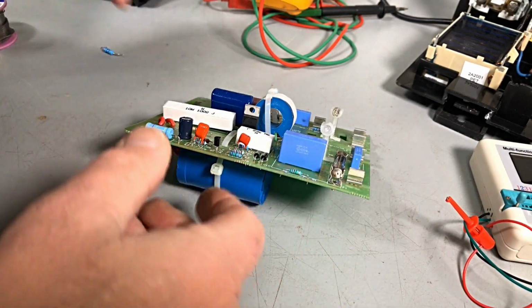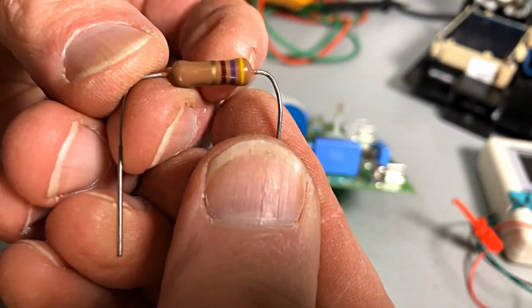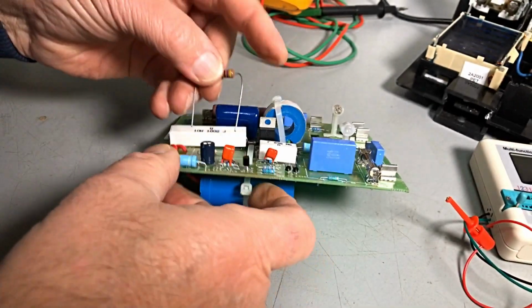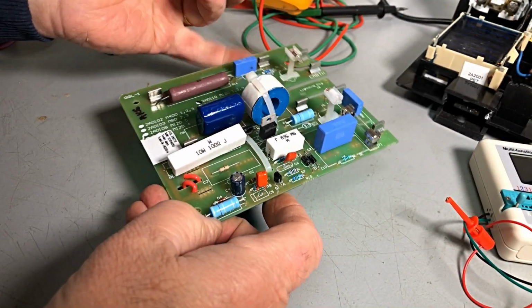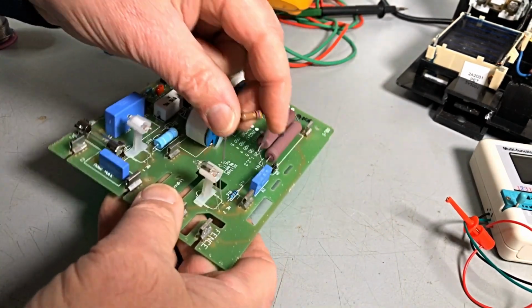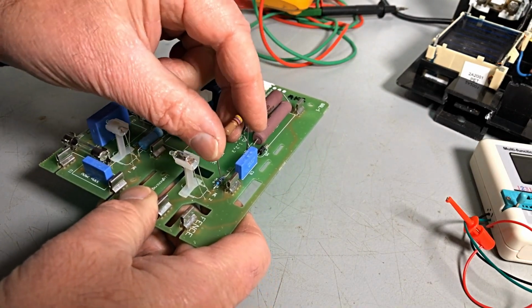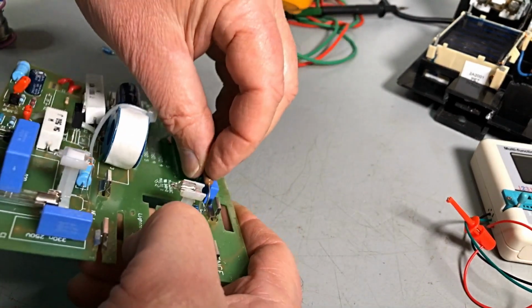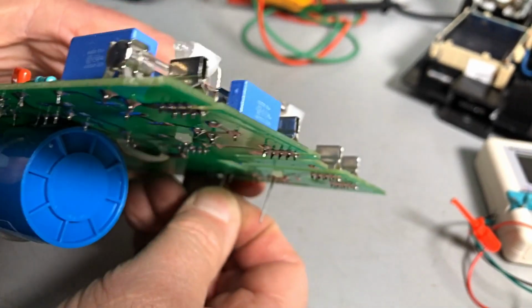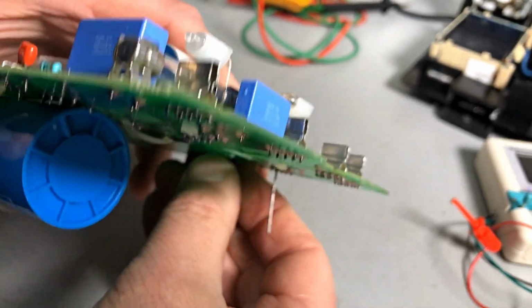Okay guys, here we go. I found 470 now for the newbies. Yeah, there you go. 470. That's for our guys out there that are learning. Now, I've got to learn where this come from. Okay, over here. And we might leave him just above the board a bit because that resistor may have run hot. We don't know. Maybe it's just a point of failure.